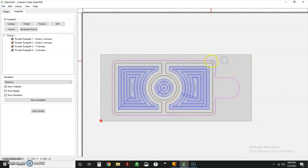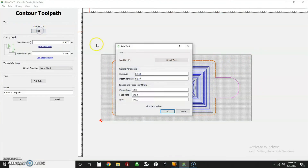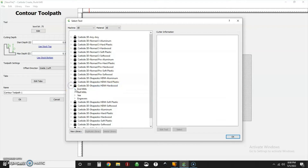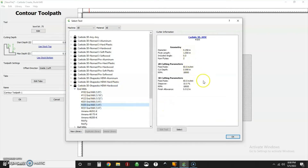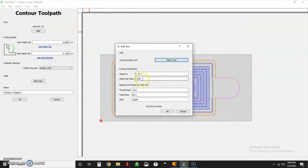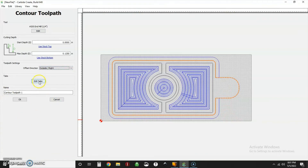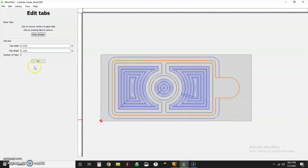The last tool path is a contour to cut this out. We're swapping bits — under the Shapeoko hardwood section I'm selecting end mill 205, a two-flute upcut. Feed and speeds look good, leaving step over, 60 inches per minute. We're going to cut to the outside all the way to stock bottom, cutting all the way through. Let's throw in some quarter inch tabs — I'll place them here, here, here, and here, not too close to the edge.